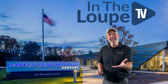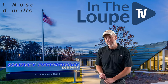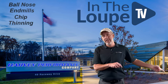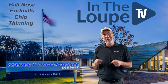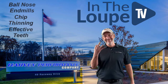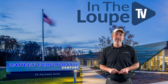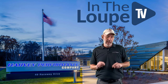Does that mean you can't use them in a three-axis machine? No. Just be mindful of effective diameter, be mindful of chip thinning on the radius, and be mindful that two teeth on a four flute ball nose are cut back. So if you're just using the tip of that tool, you might not be cutting with all four flutes unless you tilt the tool on its side. Next episode, we're putting all this together, closing out ball nose end mills — tilting that tool on its axis, using the side of the tool, maybe throwing in some programming tips, and showing how to use it in a five-axis machine.